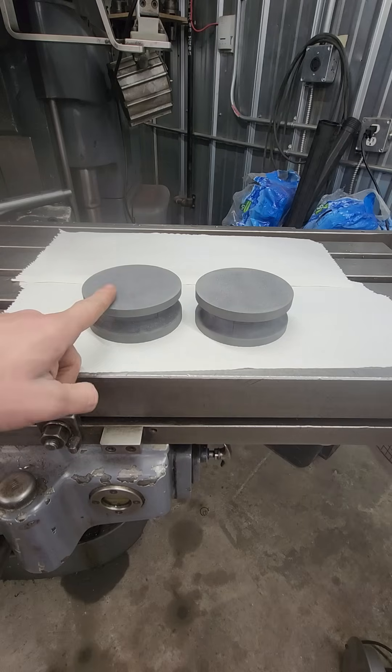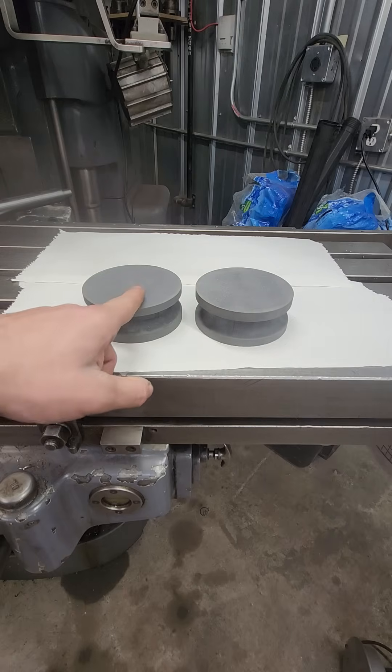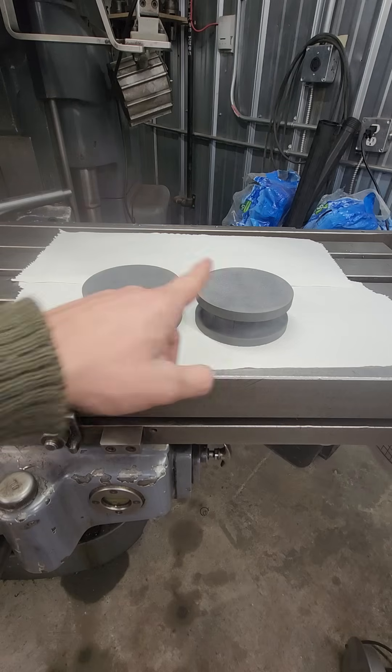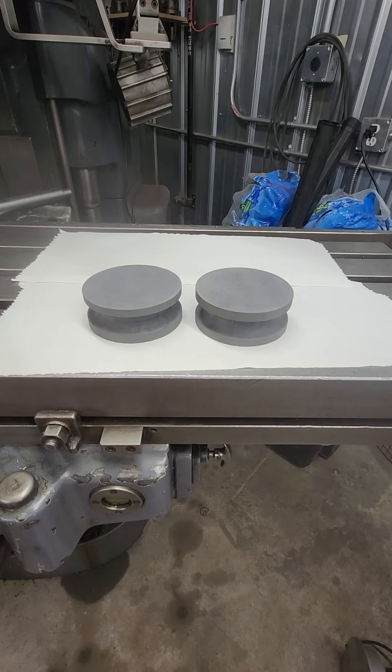What is happening with these is the silicon carbide particles — much like how when faceting a diamond for jewelry, the diamond is worn down with diamond abrasive and that cuts it — the silicon carbide will wear down silicon carbide, and it achieves the same effect of cutting down the abrasive grains. So, is this saying there's anything wrong with the surface ground stones, that there's an inherent problem with them? No, absolutely not. There's the finished product — there's no difference.